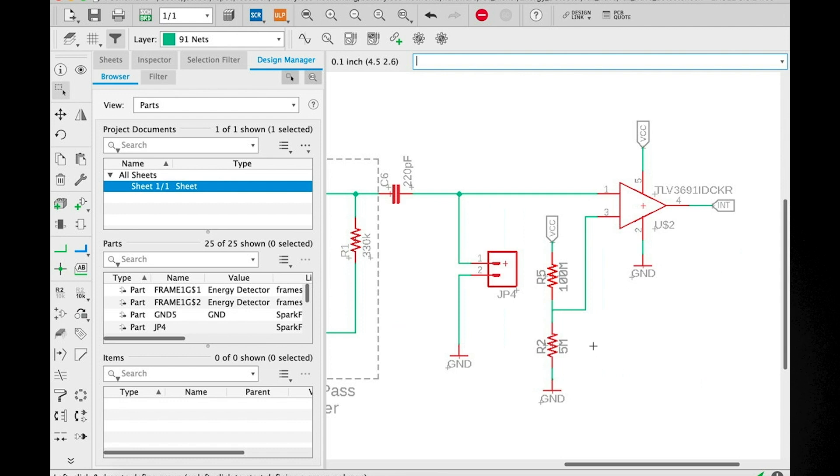Here's an example schematic from one of my projects. The schematic phase is really just about connectivity — what are my components and how are these things all connected together. You're specifying values and names and things like that, but not actual layout. Regardless of which software package you're using, you typically have access to a bunch of different component libraries, so you don't have to design all these parts yourself. You'll have resistors, capacitors, inductors, jumpers, as well as some integrated circuits — often provided by manufacturers or someone in the community who made a package for you, which can be really handy.